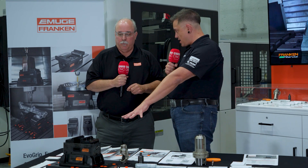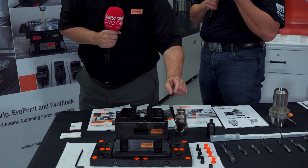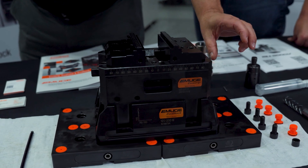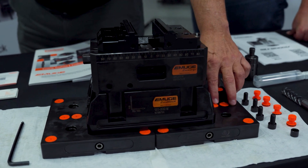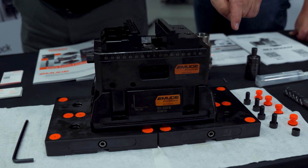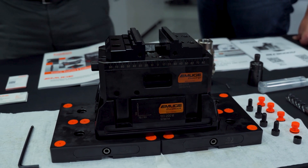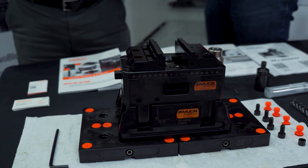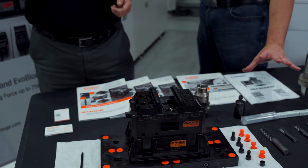Can you tell me a little more about what it's sitting on? These two zero point plates — this particular one is a 96, they also come in 52. They come in blank versions too, so the attachment points to your table wouldn't be there; it'll be clean and you can drill your own holes for a custom fit. We can connect it to the machine table — nice, rigid, repeatable. The repeatability is five microns.